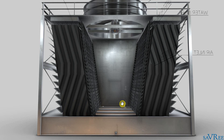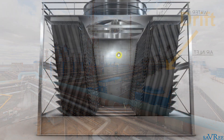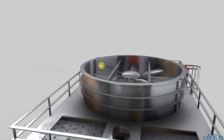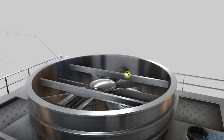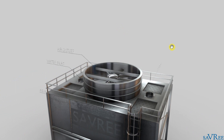Whilst the evaporated water molecules pass through the drift eliminator — some will impinge upon it — those that don't will pass up and out of the tower. We'll see this as a column or a plume of moisture exiting the tower. This water plume is drift and it represents a water loss. If you have a lot of drift coming out of the top of the tower, you're actually losing a lot of money — water nowadays is quite expensive. So if you have perhaps 2%, 2.5% just drifting up and out of the tower, you're going to incur additional operating costs. We definitely want to operate the cooling tower efficiently and at a low cost.